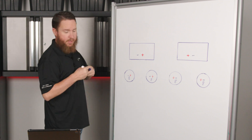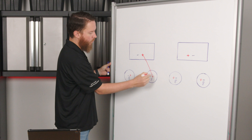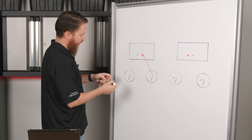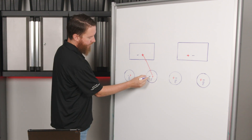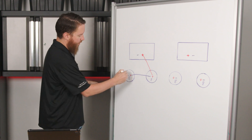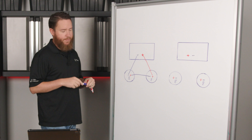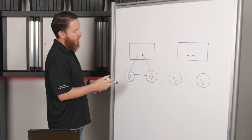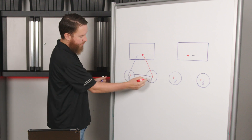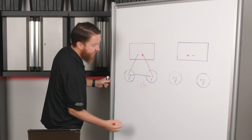The first step is we're going to take our positive wire from the positive terminal of the amplifier and wire it to speaker one. We are then going to take the negative and wire from the negative terminal to the positive terminal of the next speaker, and then from there wire back to the negative terminal of the amplifier. When we do that, this is wired up in series, and this is going to take the two speakers' impedances — 8 and 8 — and add them together to give us a total of 16 ohms.